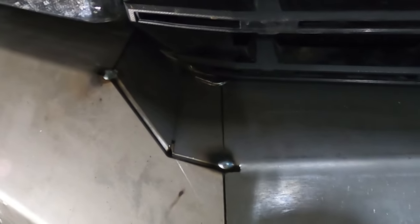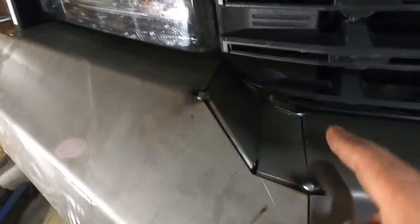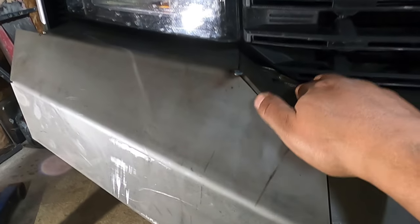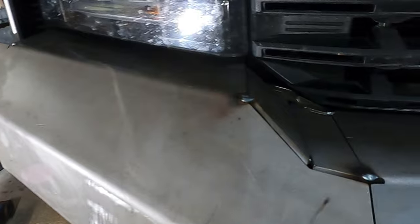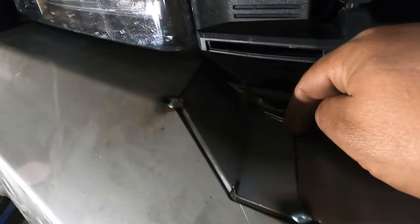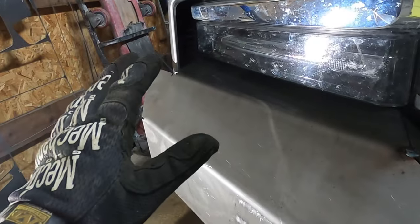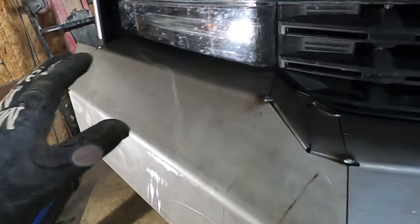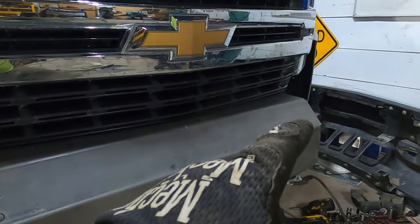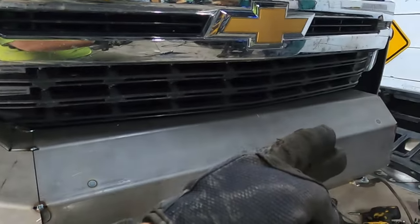For this little angle piece, I tack the front, I tack this upper corner, and then I snake the clamp in up from behind to flatten that out. I'm very carefully going to shield this and get a really good tack here and a really good tack here, because that's going to help make sure that this end of the wing has stability. We'll move on to the end piece — I won't record that side for time's sake; you're going to do the same thing over there.